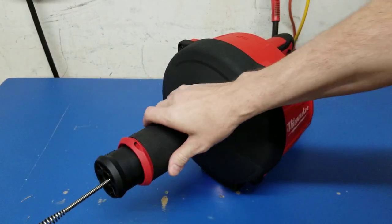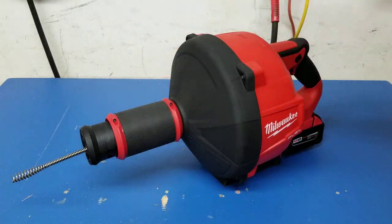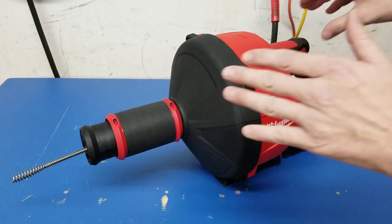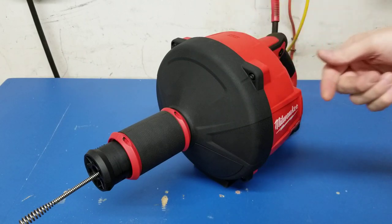The cables are extremely easy to take out and clean — you just pop it into neutral, pull the cable out, and clean it. They're just as easy to put back in. What's really nice is that about three feet from the end of the cable there's a bulb built into it. When locked into the feeding system, once that bulb hits the mechanism it will not go any further, so you don't run the risk of accidentally feeding the cable down the drain and losing it. Also, two screws here and two in the bottom and the whole front section comes off so you can access the inner drum and clean it out easily.